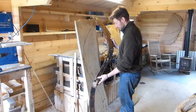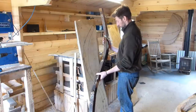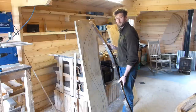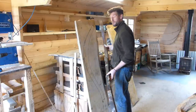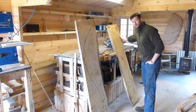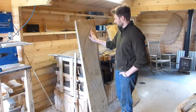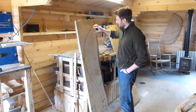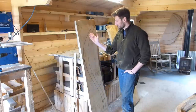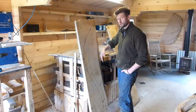We've managed to get our frame out of the boat, albeit in two pieces. We simply take the rib stock, plug it on, draw around it, and that's what we're going to use to start. I've done that already for both sides. We're looking to avoid any major knotting. Ideally I'd have the grain running full the way round in that curve but I'm utilising the grain as much as possible so we're not going across the rib anywhere - or at least not too much. It is a little bit through in the top section but the grain does curve a little there and it's nice and wide anyway.